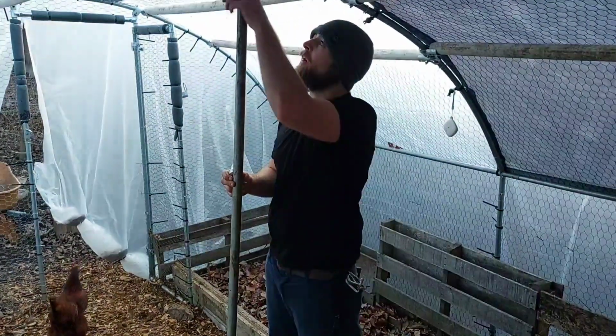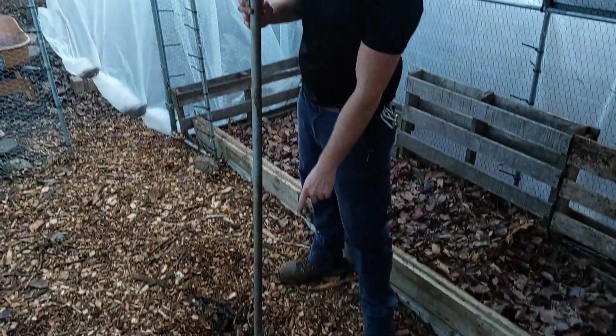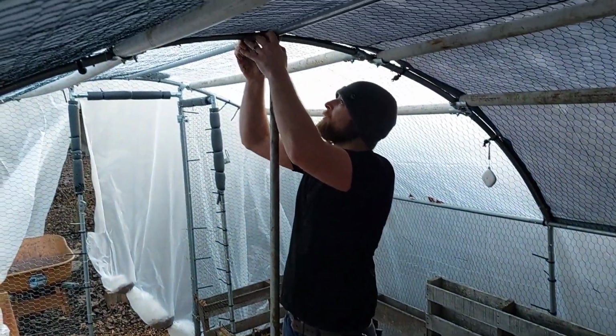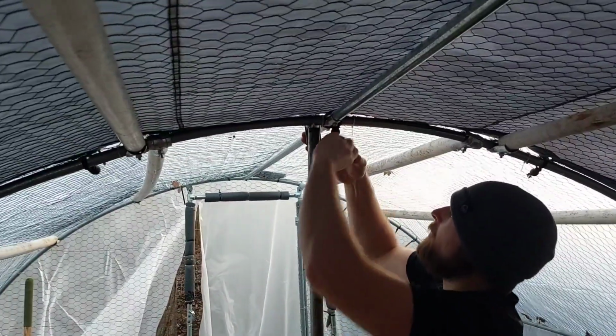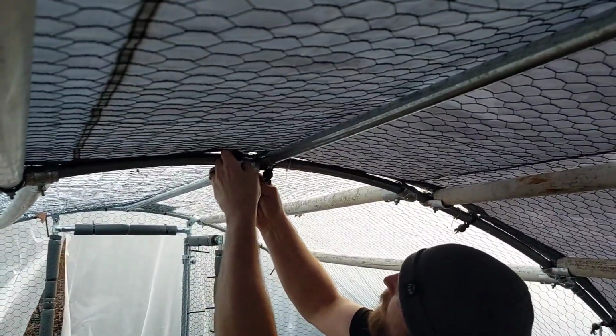All right, y'all, so we got our center support here cut, and down here I actually dug in this piece of wood for it to sit on so it doesn't sink down under a snow load. So now all we got left to do is raise that up and hold that in place and get in the other half of our clamp